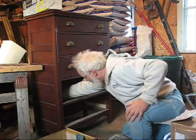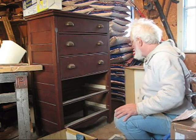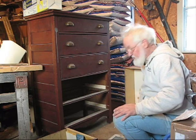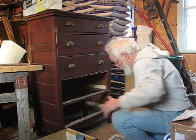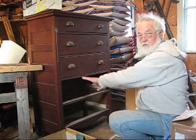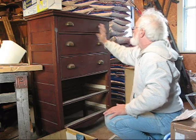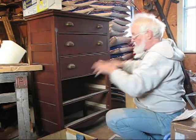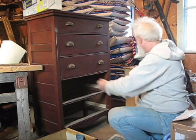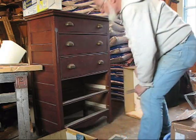It stops so that the front of the drawer is level with the cabinet. I mentioned a while ago that I'm going to church this morning, so what I'm going to do is glue that block in place — here, here, there, and there, all along through here — let that dry while I'm in church, then when I come back I should be able to take this thing upstairs and start using it. I wanted to share that because it's important: those little blocks and these little side blocks help everything to work smoothly, which is what you want — nice and flush and pretty. This looks tremendously better than if the drawers are all shoved way in or sitting sideways.